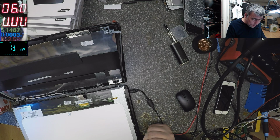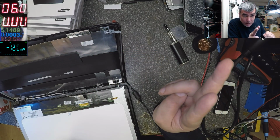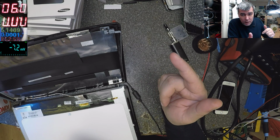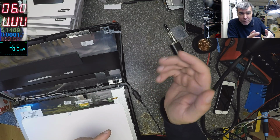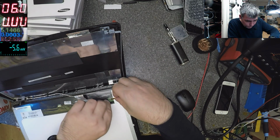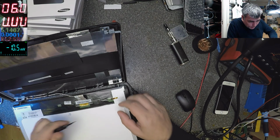Yeah, what I told you. Probably one of that signal is missing. But I don't understand how it's possible. That's to see those two signals. Yeah, it's a signal when it's on. It has 3.3 and will start the inverter. And the other signal, I think, is from 0 to 3.3 and is the dim, the brightness signal. Yeah. So one of that signal is missing. That's the thing.